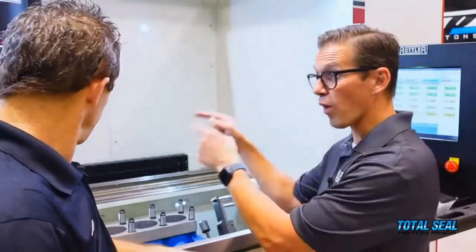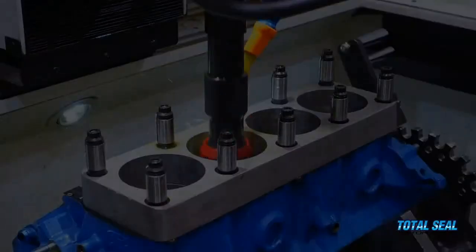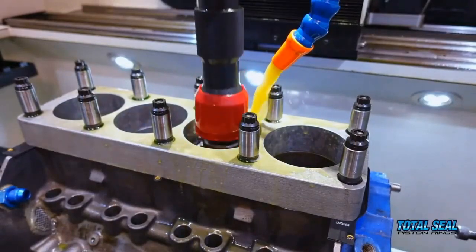Oil is there to be the lubricant and the seal — it's the gasket. Everybody used to hone a block very fine, thinking friction is everything. A 325 grit abrasion was pretty common — less friction. But then you run out of oil and you're creating friction again, so it completely reverses on you. We learned over time you've got to have those valleys to hold the oil. So step two: we use a 170-200 diamond to create those deeper valleys, then come back and plateau over it with a 600 CBN. You get those valleys, then put a smooth finish on top — plateaued on top, low friction, but you've still got oil capacity.